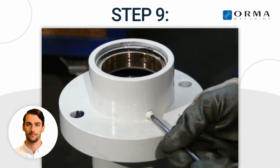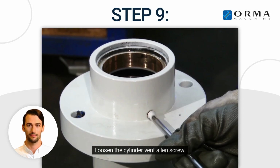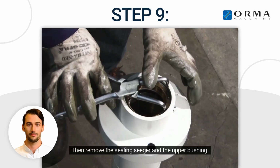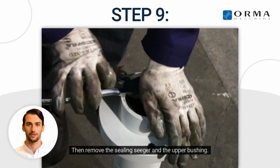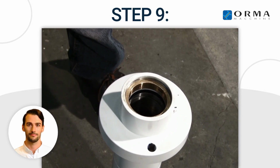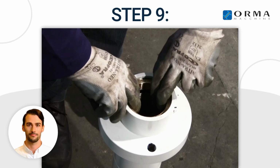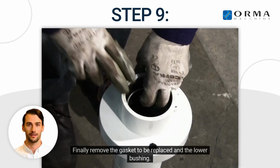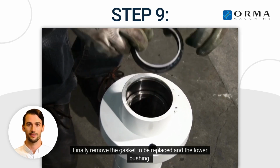Step 9. Loosen the cylinder vent Allen screw. Then remove the sealing seager and the upper bushing. Finally, remove the gasket to be replaced and the lower bushing.